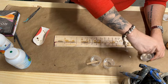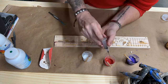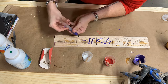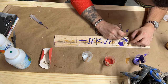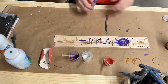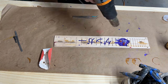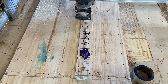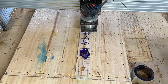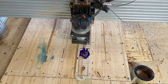Inlays are a little bit different here at Mad Lad. The way I do inlays is a little more flexible. Nothing against using Mother of Pearl or any of the traditional inlay materials, but I actually like using epoxy. Epoxy gives kind of the same effect as abalone or Mother of Pearl — it's got that swirl look to it — but I can mix it with mica powder to get all these cool effects and swirls. I'm not limited to buying a sheet of Mother of Pearl for every single color; I can just mix it up with mica powder. After hitting it with a heat gun to get the bubbles out and everything is set, we take it back to the CNC machine and carve the actual radius of the fretboard.